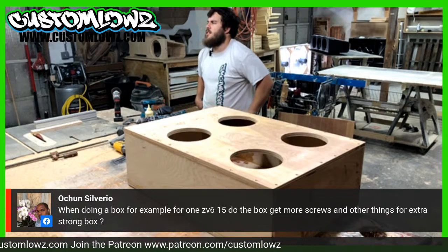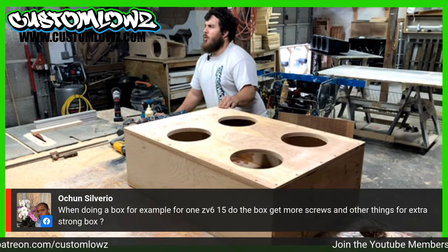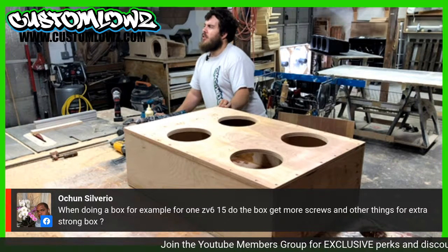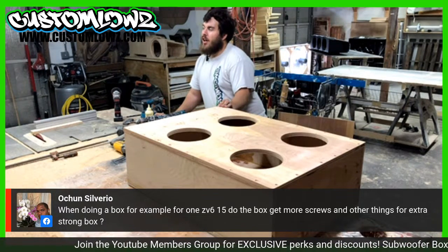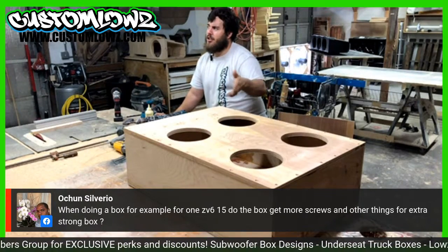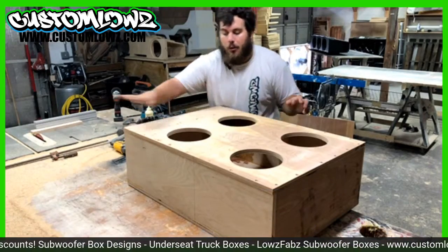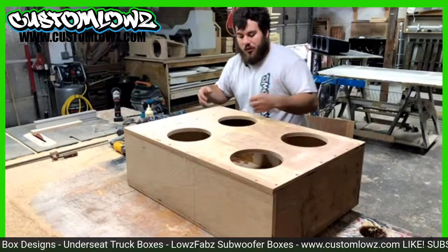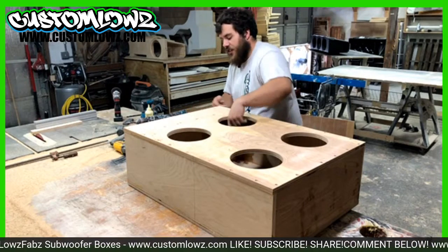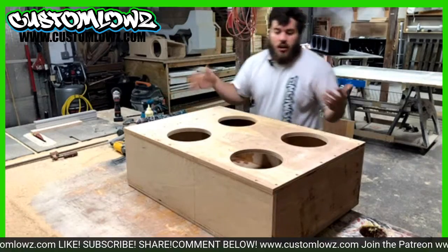All right, I'm going to take a second attempt at pronouncing your name. Ochen asked, when you're building a box, for example, for one ZV615, do the box get more screws and other things for extra strong box? So I'm going to break that down as you're asking. Does it get extra screws and bracing to make it a stronger box? Yes, it's all going to depend on the situation, how I am going to build the box. You will see with me, I always do a double baffle minimum for everything. For your ZV615, I'm going to do a triple baffle for sure. It's a heavy sub.